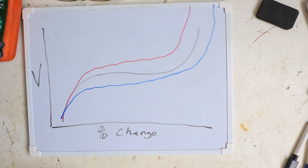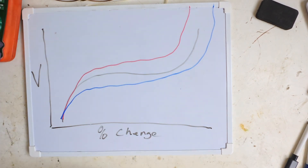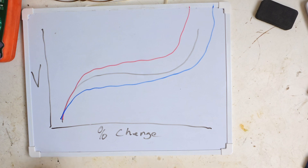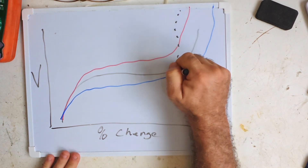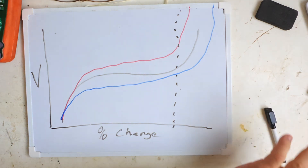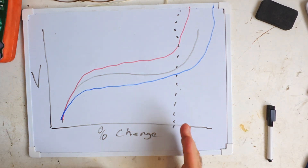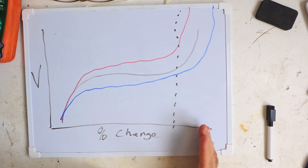If I'm charging fast, I can go to a very high voltage before I'm at 100%. But if I'm charging slow, I'd better stop way down at a lower voltage. If you could do this in a lab where you can control the charging rate, you can use this kind of graph to decide when 100% has been reached. But 100% isn't this peak voltage when the cells are about to explode — 100% is really probably right around where if you charge beyond it, the batteries will start damaging themselves. Not instantly, but they will greatly shorten their life.